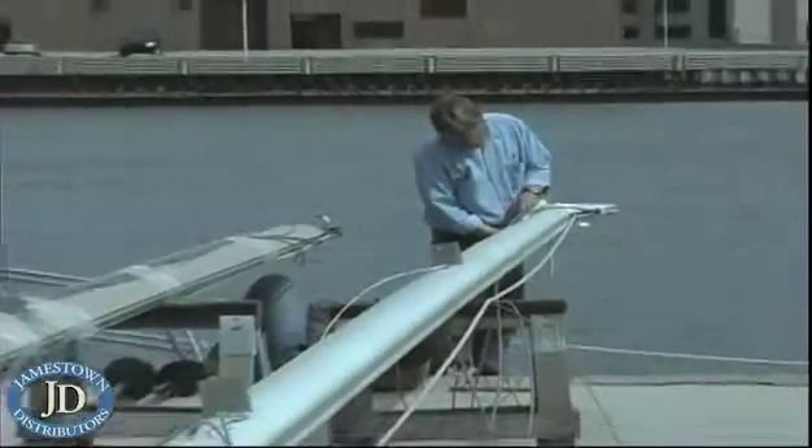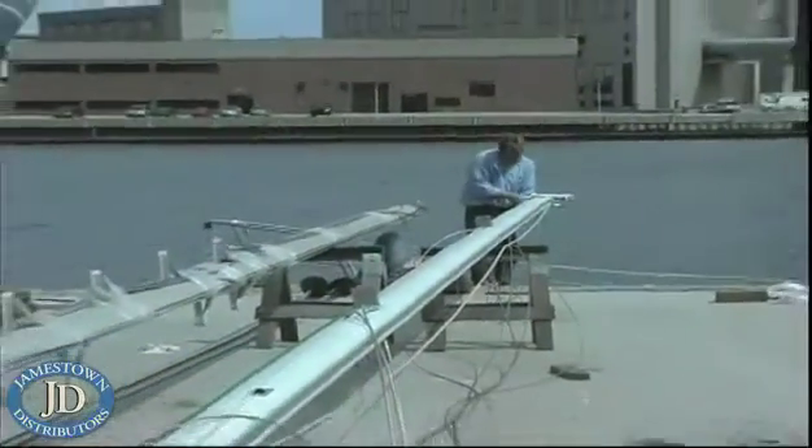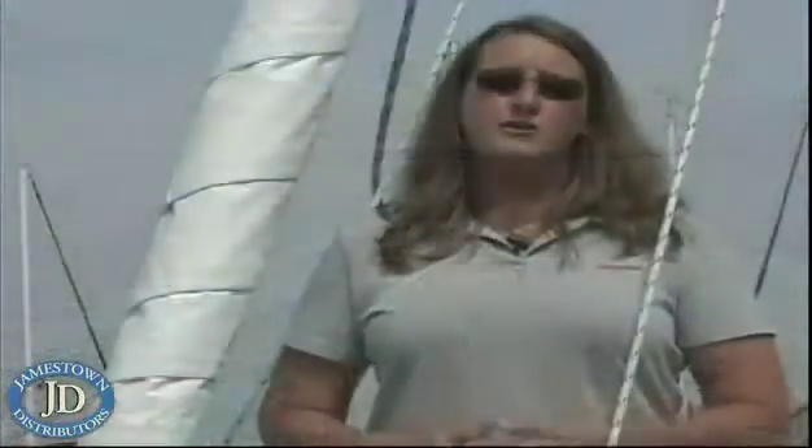When you do lower the upper swivel, do the same thing — just work some soap and water down into the system and flush out those ball bearings really well. When you have the mast down or when you have the sail off, be sure to inspect the furler for any wear and tear. There might be screws that are backing out or any corrosion happening. If treated early enough, all that can be fixed and your furler will last you virtually a lifetime.